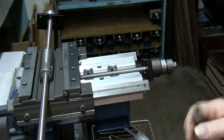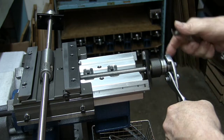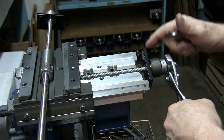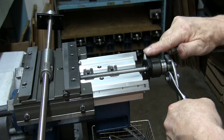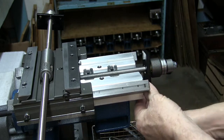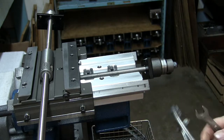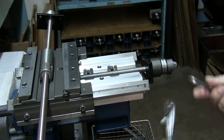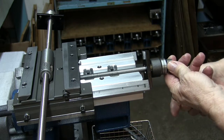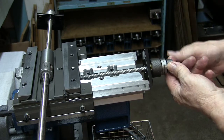Let's put some pliers on the end here and tighten it up a touch. You can get it too tight — there, it doesn't spin at all, that's too tight. Let's loosen it up just a little and give it a little tap to release the bearings. It spins, but it comes to a stop — very nice.